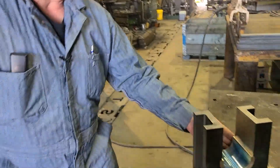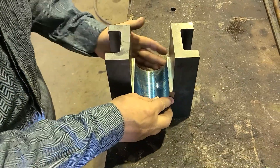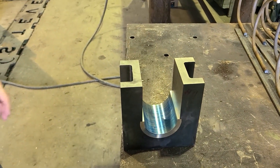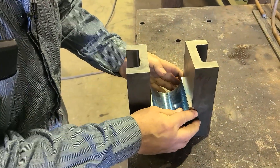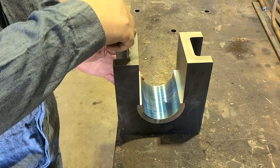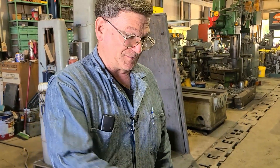There were two sizes of brass tapered pins for sale. I bought one because it was the first brass ones I'd seen in years, and the other was slightly bigger, which turned out to be good for this job — I just got those a couple months ago. This one sticks out about three thousandths, this one about one thousandth, this one is in by about two thousandths, and this one's about flush. That's close enough — some of their original bearings stuck in a sixteenth of an inch, some stuck out an eighth. So it's close.